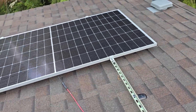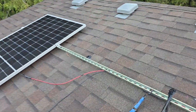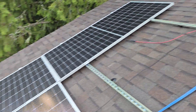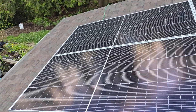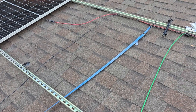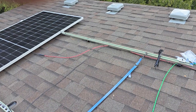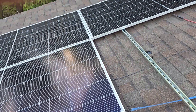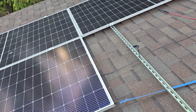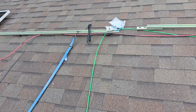Test fit before you get people up on the roof to start putting panels up. We're on a 5/12 pitch — almost a 6/12 — so if you put a panel there without tightening it down, it's just going to slide down. What I found is you can take a strap, hook it onto the top channel metal and then hook it on the top nail, and it will actually hold the panel in place while you do what you need to do. That works.